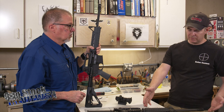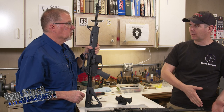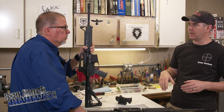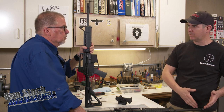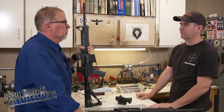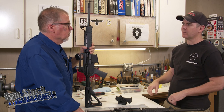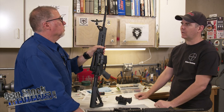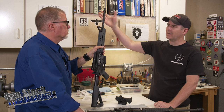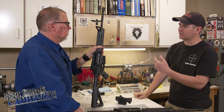In the olden days, you would bore out a rifle barrel slightly oversized and then have chrome plating put inside. Sometimes that plating goes in slightly uneven — and that unevenness is now acting like a cheese grater on your bullet. It lasts for a long period of time, but it's a cumbersome process. Glock famously had their Tenifer, which is something very similar. With nitride, they machine the rifling to the exact size, then apply the nitride heat treat process, getting the resilience of chrome lining — and even on the outside it's actually very strong, like an eggshell. It actually improves its resiliency and makes the barrel last longer.